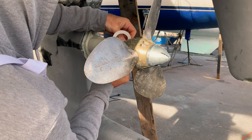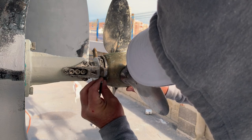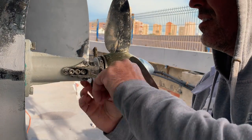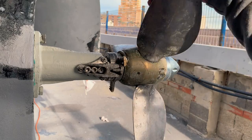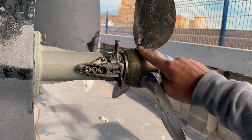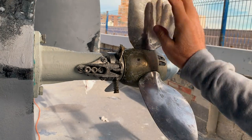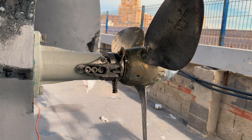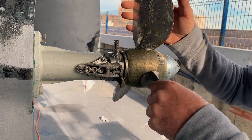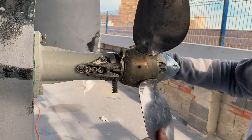Reassembly is exactly the reverse of disassembly. There are four retaining screws to reattach — put the sacrificial plates on, tighten everything up by hand, and add a little thread lock to those screws to ensure they don't work loose. Simple job, should take no more than half an hour. Please watch your fingers — rope cutters are fiendishly sharp. About half an hour later, still 10 fingers intact, both sacrificial discs are back in place. Final check to make sure the prop turns freely and does not bind — job done.